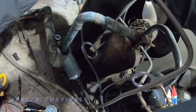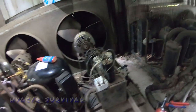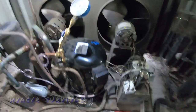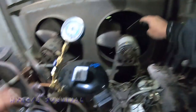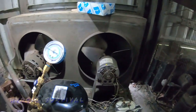Open this back up and check for leaks. I've got to get that motor changed — all I need to do is open that just a little turn so it lets the pressure through. We're going to set the low pressure switch and make sure it's accurate before we get the condenser fan changed. That motor's bad — both motors are bad. It went out on overload, so not only did we have a switch out of whack but both motors are out. It's always more than what you think.